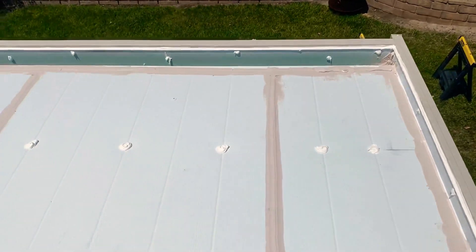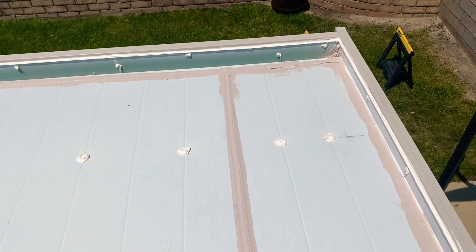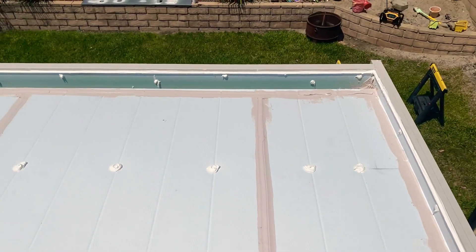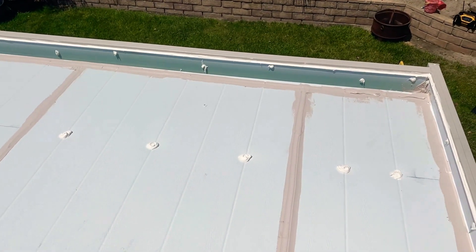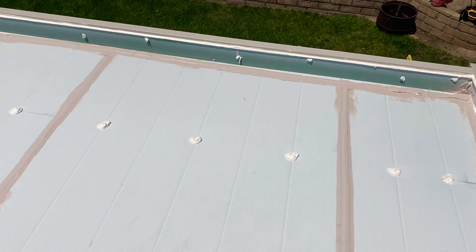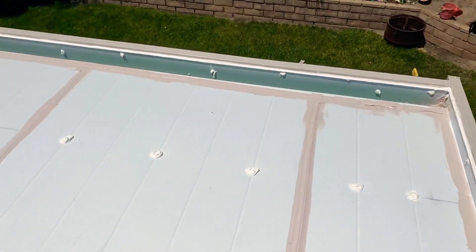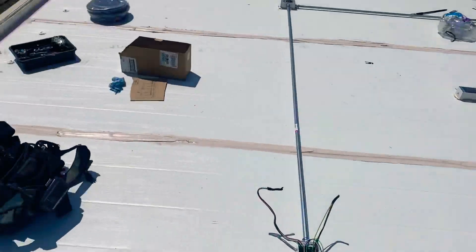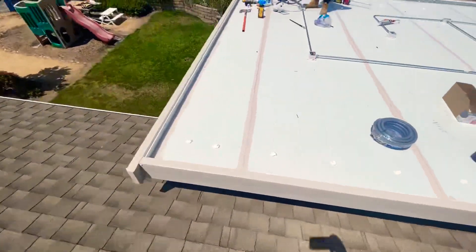It's very important when you jump on top of one of these aluminum patio covers, especially the insulated ones. It's important to me that you do not see one screw at all whatsoever, so that the water cannot penetrate through that screw. Some of them will have neoprene washers and you do not need, supposedly from the factories, to seal it. But why not just do both? So I encourage the guys — more sealant, the better. They've got all this metal conduit up here. Here's what it looks like from the top.